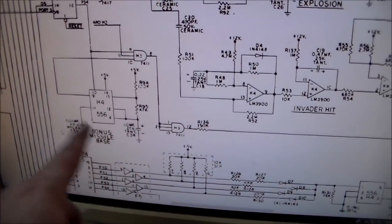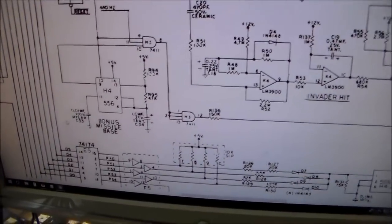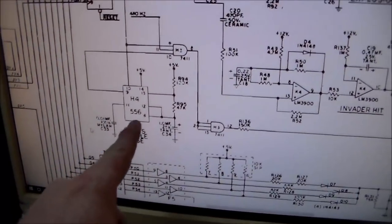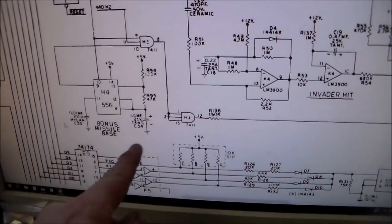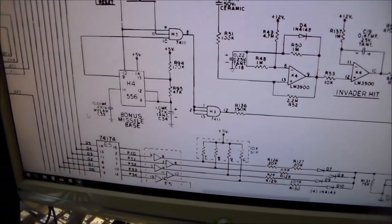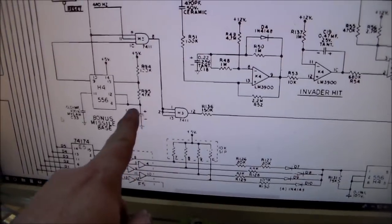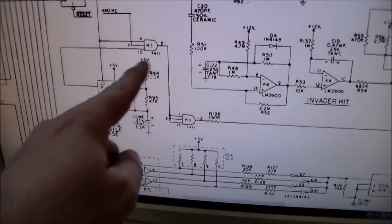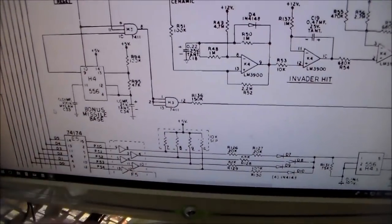But I just re-soldered that chip, so I probably messed something up. I don't know if it was working beforehand though. So what I'm going to do is use a multimeter and check all of these connections. And then I'm also going to check this cap right here too. That doesn't look right. Oh, somebody's already replaced it. So I'm going to check all the connections and everything, and then worst case, we might have to swap that chip again, but I think it's just going to be a bad connection.